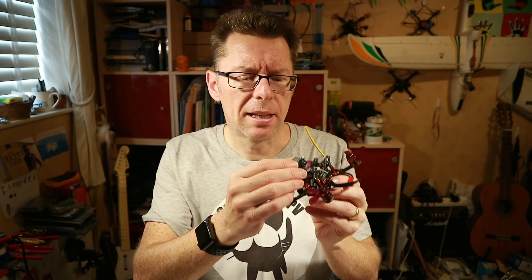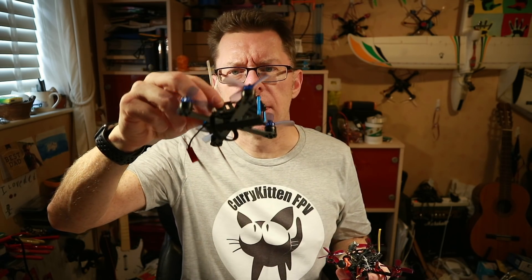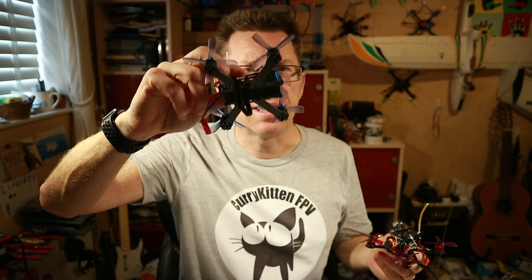You can see straight away that the little Thera with its TX03 VTX was getting a better signal than the QAV 105 — could be down to the position of the skews or the VTX itself. The thing I took from this is that a skew does an okay job, but it was definitely enhanced by adding a directional antenna as well. Certainly working diversity helps, especially when you go behind yourself. I was going to show footage flying behind myself with directional antennas, but the diversity system switched to the other antenna and actually got a better signal that way.